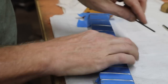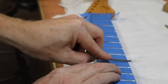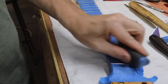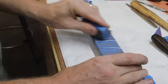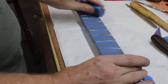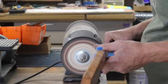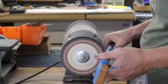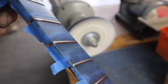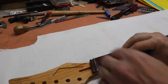You want to make sure there are no sharp corners there to catch someone's finger. Then I sand and polish the frets when I'm done. This is a roll of plastic — like dog poop bags, believe it or not — rolled up with sandpaper from 400 grit up to 3,000. What I like about it is it can contour over the frets instead of using my finger and getting it stiff. Usually I would use buffing blocks from nail salons, believe it or not, but since I had this neck off the instrument — it's not a neck-through — I just went over to my buffer and buffed it out, which gives you a nice shiny finish there pretty easily.